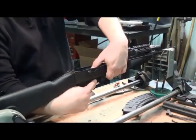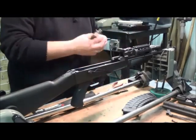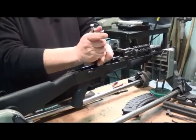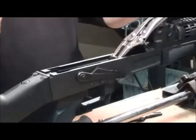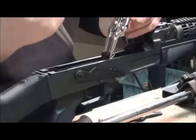Let the hammer up slowly. Once it's up, take needle nose vise grips and clamp them on the hammer. Then reach in and wind the hammer legs onto the vise grips.